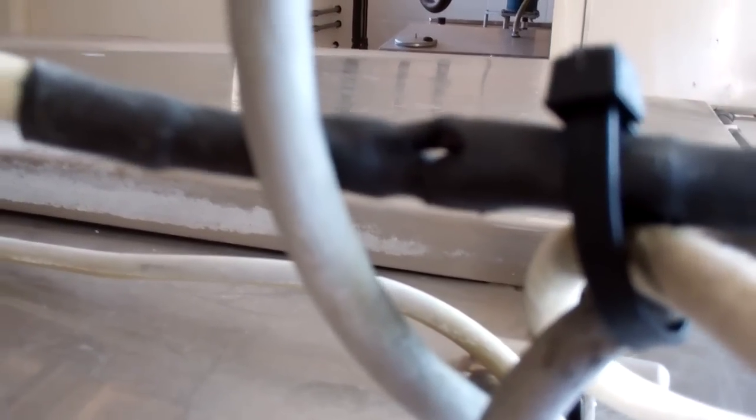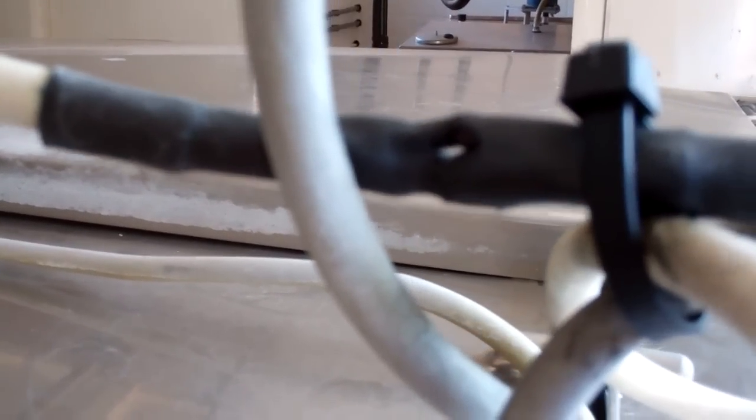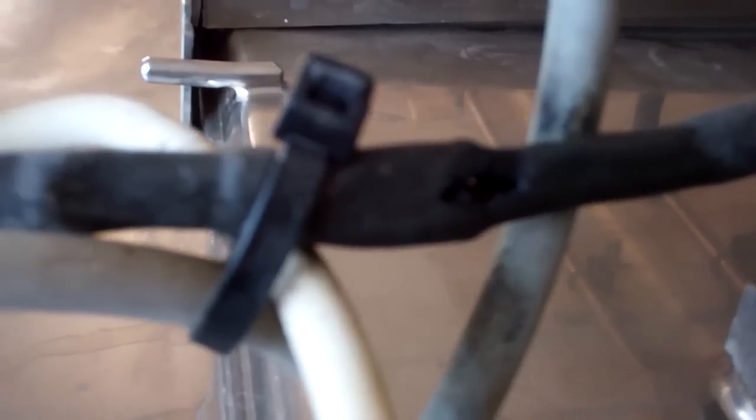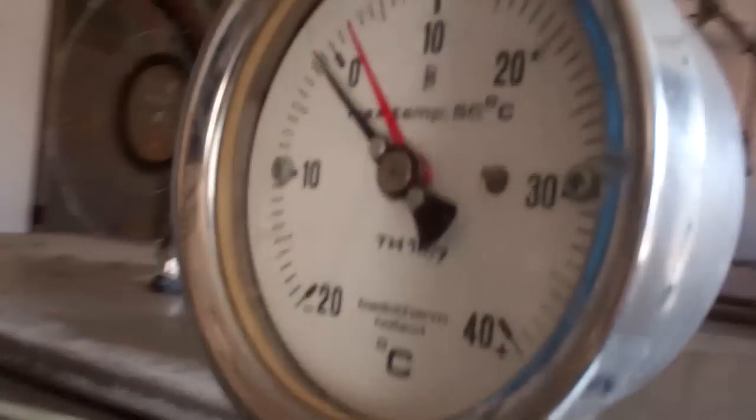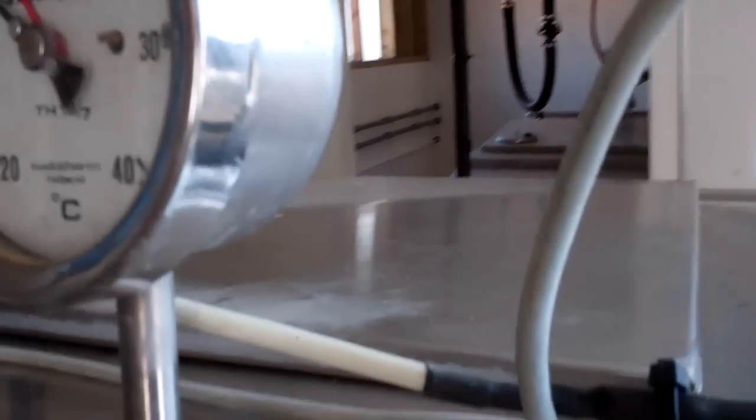It's had damage done to the cable in the past by the look of it, and it's been joined back up and heat shrunk. It appears there's probably got some moisture in there, and it's all shorted out, probably shorted out to the earth. So I think you've got live in, live out on earth to the batotherm. So yeah, see what you can do with this.